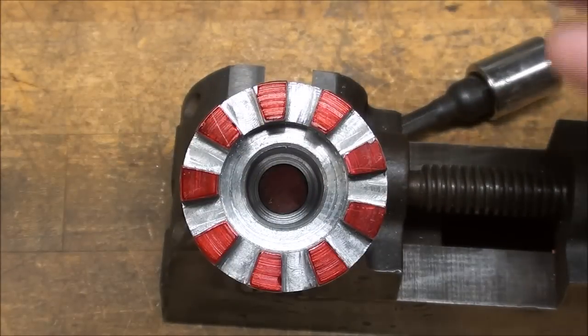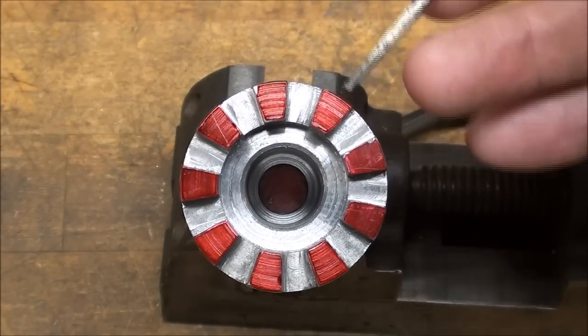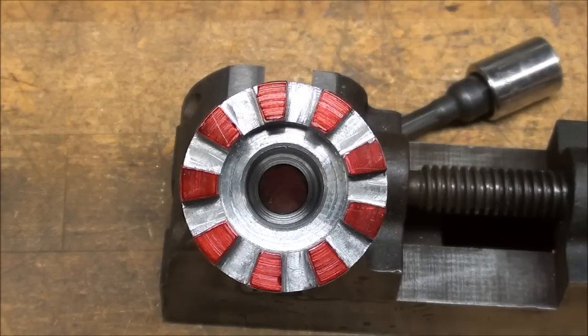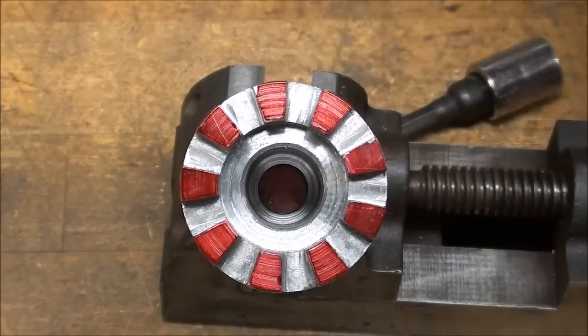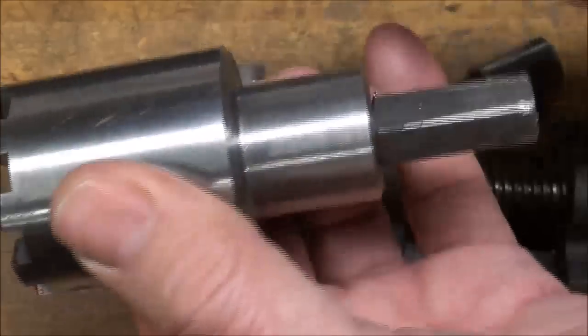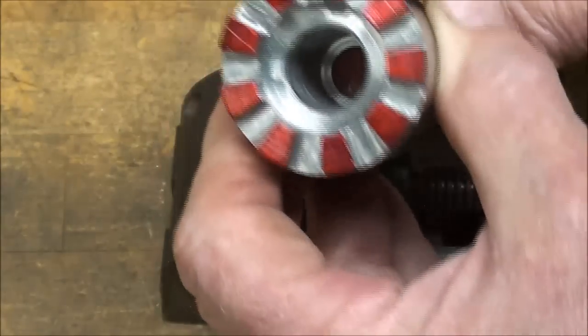To make things even more difficult, not only are the cogs 20 degrees apart, but the shape of each cog and each space is tapered at 20 degrees. So there are all kinds of angles to consider and accommodate as we machine this. I'll show you most of that when we get over to the Bridgeport mill, but first I'm going to do the initial machining — all the holes, drilling, and boring.